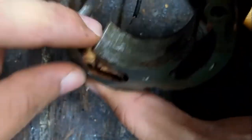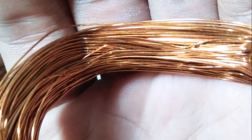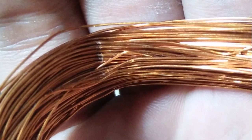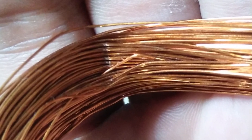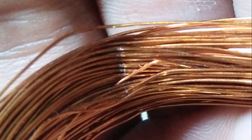You may think the copper wires are coated with thin insulation, right? Well, yeah, but you can never be safe unless you take precautions. Always remember that in the process of rewinding, there are times that the wires get scratches from the sharp edges of the metal, removing the coat and creating a short circuit.